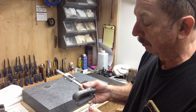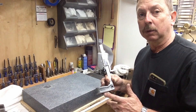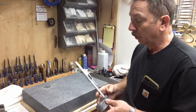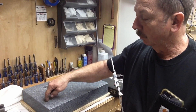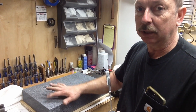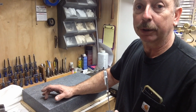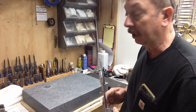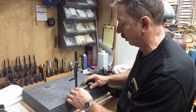The reviews on these have not been great, but if I really wanted to use it as a surface gauge for general use, maybe I'd be happy with it, maybe I won't. But all I want to do is measure tool lengths. My long term plan — and I've got one ordered — is we're going to drill a 7/8 inch hole into this surface plate so that we can set our Tormach tools down in there and measure our tool height just like they would be done on the standard Tormach gauges.